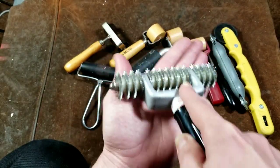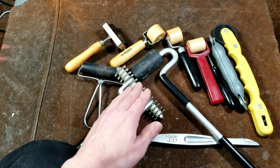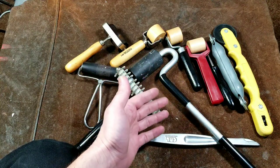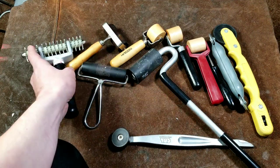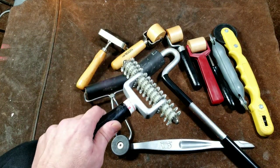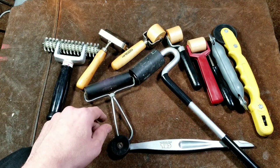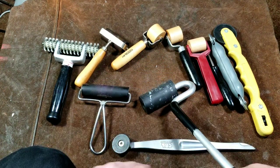And there's oftentimes where just a proper application of these rollers, not only do you get a real good, well-glued carpet seam, but it can blend the seam to the point to where you can't see it. And it may show up after wear and use over months and years. But initially, you can use one of these, and man, it's amazing. It can make the seam just disappear, and it's surprising. I've replaced sections of carpet, cut them accurately, and used this just to paste down the new section, and it looked like nothing ever happened. A J-roller is good for that, too, when you have the thinner, more office-style carpet.